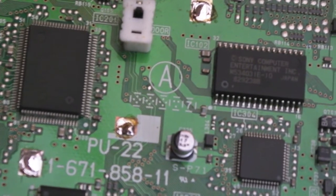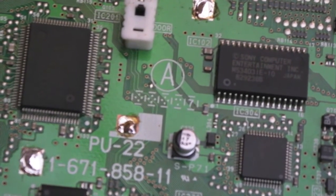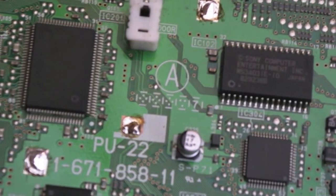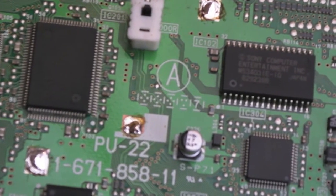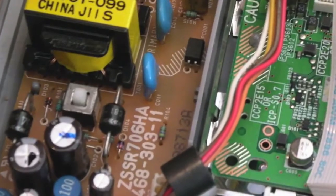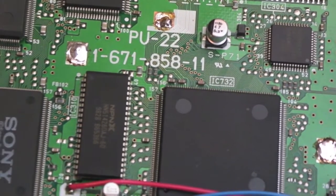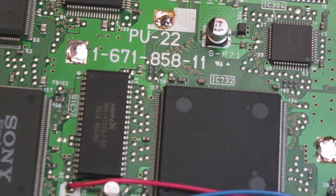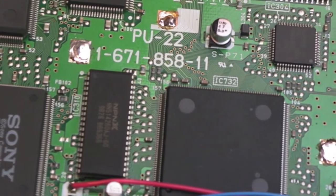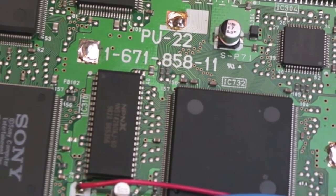I'm experiencing some odd behaviour with the CD drive on this. For the first few minutes it can struggle to read discs a little bit, but then when it warms up it's fine. It's very odd — it only seems to be on reading discs. I don't know whether these SMD caps need replacing, maybe all of them need doing. I've checked all the caps on the power supply — taken them all off and had a good look, they're absolutely fine including the main cap at 400 volts. Let me know if you've got any experience of this particular model. I've just left it running for a few hours and it's been absolutely rock solid, but if I switch it off and leave it overnight, it'll struggle for the first five minutes.